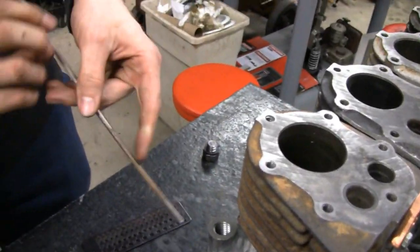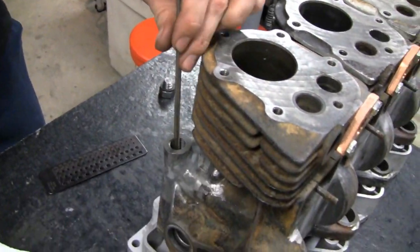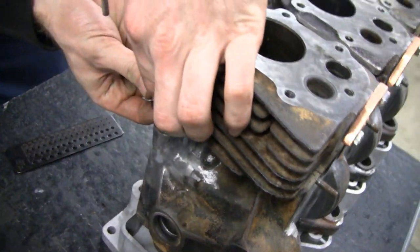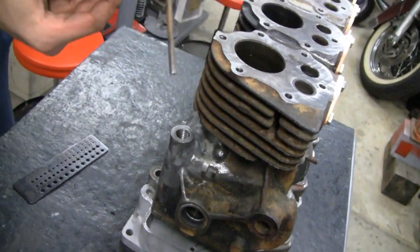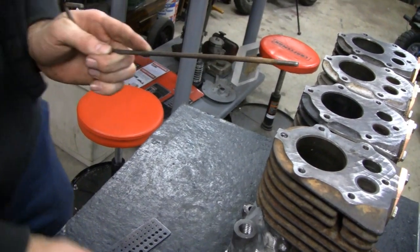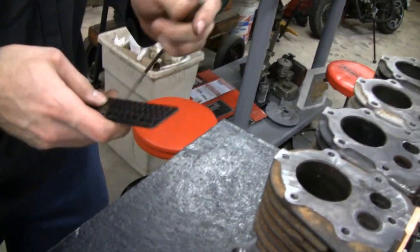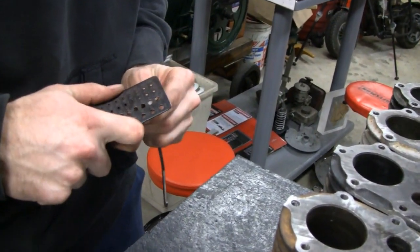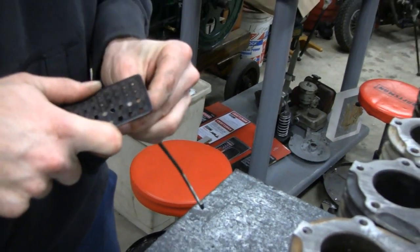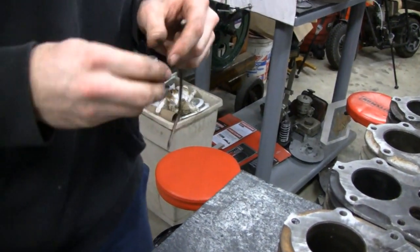What you got? What are you doing there buddy? Found a piece of stock. Put it in there, cut it off, put it on this — drill a hole in there and press it in. A drill gauge too. I think we'll use a number 14 drill and press it in there. That's cool — it'll be as snug as a bug in a rug.